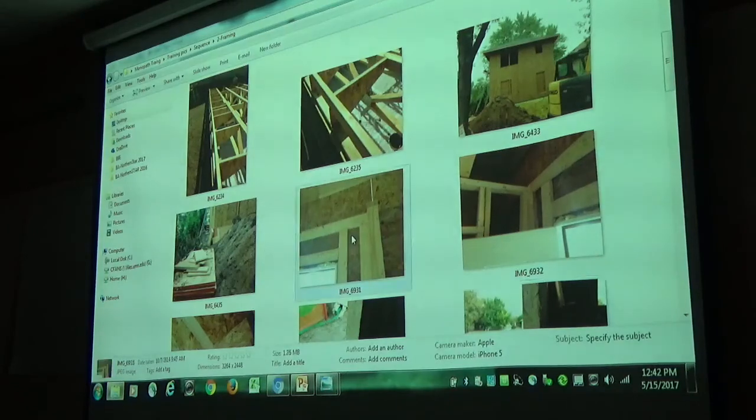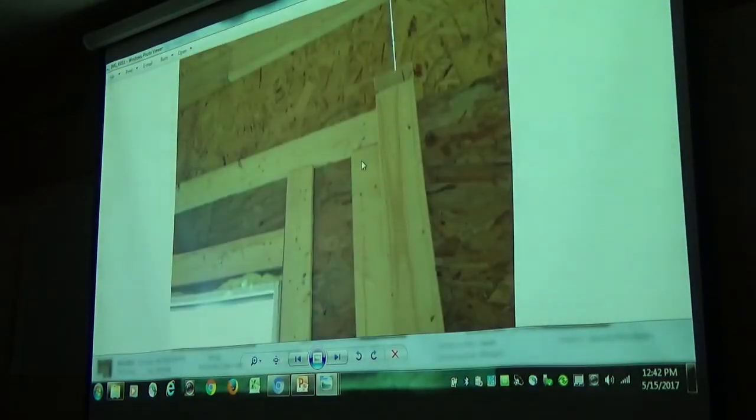Some other interior wall details, you'll see that on the plan, there's some on the exterior walls, you're going to see some furring out that needs to occur, and these happen at the front and back door. This provides us with enough material to put in a standard door jamb, like a 4 9/16" jamb. Also allows you to have an electrical chase right there and put a switch on the outside wall. And we'll get into the electrical later, but all